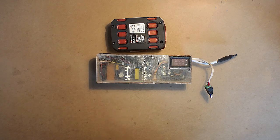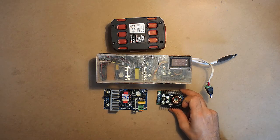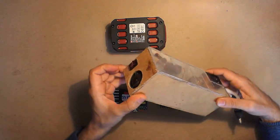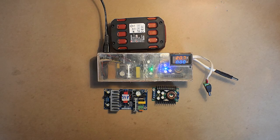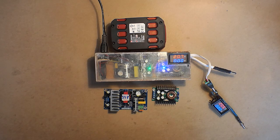In view of the battery voltage, here we have a power supply unit designed for 24V, like this one. As to the DC-DC converter, here we have exactly the same one. The output voltage amounts to a bit more than 20V and the output amperage amounts to 1.5A. It's recommended to charge lithium cells with a current of 0.5C, which for this battery amounts to 2A, but I've adjusted the charger to a bit less current in order to avoid overheat, especially in view of a very small fan cooler. Here we have 20.7V, and here we have output voltage of the power supply unit: 24V. So the accuracy of these volt-amp meters is acceptable.